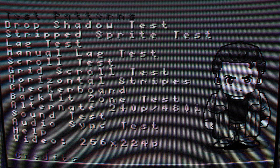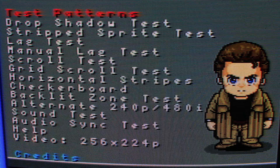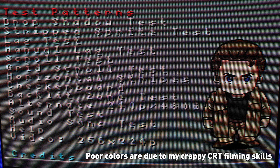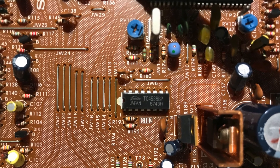Here are shots of the three different signals. We've got the black and white direct S-video into the monitor — that looks quite nice, quite crisp, besides the lack of color. If we go over to the S-video RGB encoded version, we can see there's definitely color bleeding on red, and also slight color bleeding on blue as well. By eyeballing it, the converted version of S-video is actually slightly lower resolution than the original S-video version. Finally, here is the direct RGB output into the monitor — and we can see that this looks crisp, clean, and beautiful. So why does this unit bleed red and blue? My best guess is that after 33 years the capacitors have gone a bit off spec — completely normal. Looking inside the unit, there are no leakages happening right now, so it's not an immediate problem.